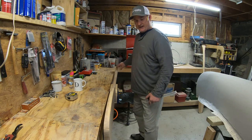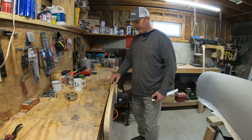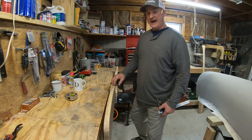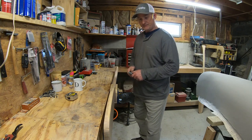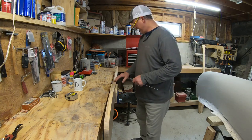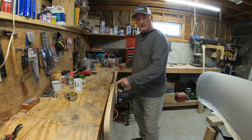It's recommended that you actually do the grip, the blade, and then work the canoe paddle shaft — in that order, in that sequence. It makes sense because it gives you a clamping surface for the shaft and you work from there. So I'm just going to go ahead and mark out this blade thickness and then start adding the templates, taping and drawing those in.